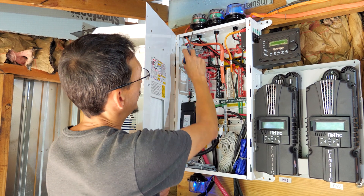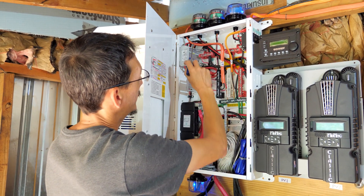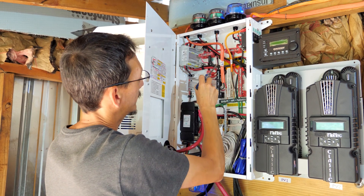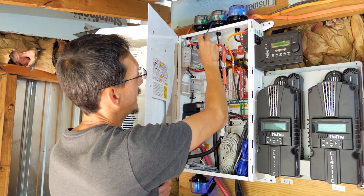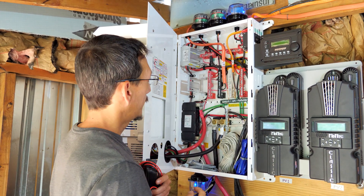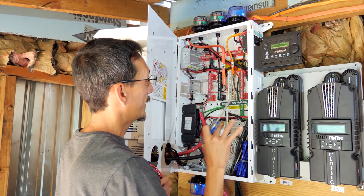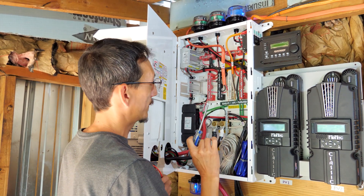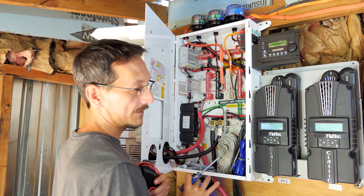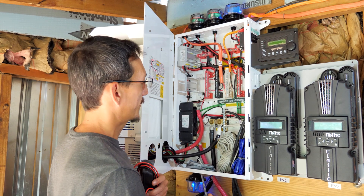All these SPDs are AC-rated surge protection devices. Each circuit — the line in from AC has one, the line out from AC has one, and then these are the DC ones for the solar. So everything in here is labeled, pre-wired, very well done. All the cables are properly sized. I'm really impressed with Midnight Solar and how they put these together — it's very easy to understand. They send you all the instructions for wiring things.